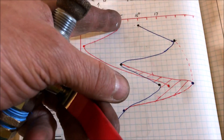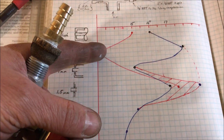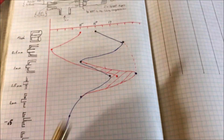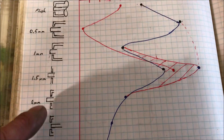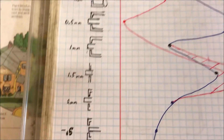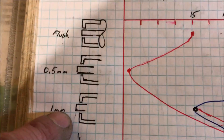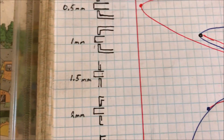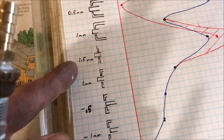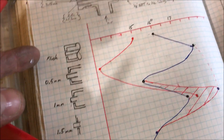As you start off flush, you're pumping a certain amount, and then the flow seems to diminish a little bit, at which point it picks back up drastically when you get to the 1.5 millimeter position. I should have drawn these in a better ratio - these are not ratio-specific in the drawing as they should be. But in conclusion, you get the highest vacuum with a 1.5 millimeter extruded position, but you don't get the highest flow. Flush is the highest flow.